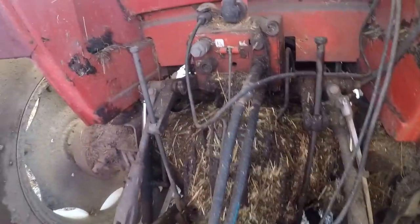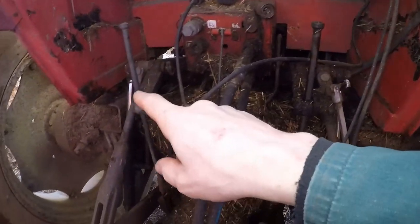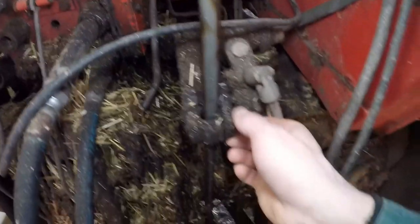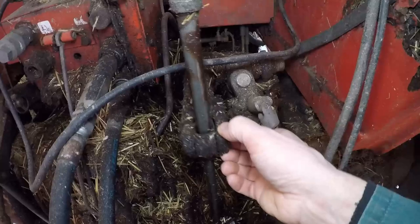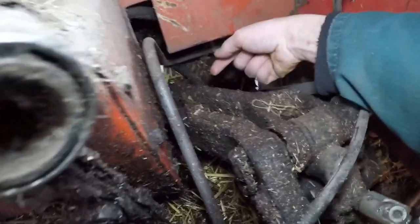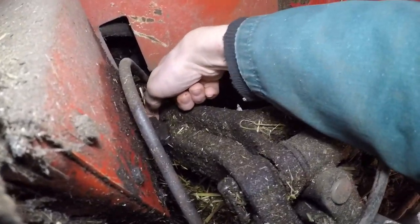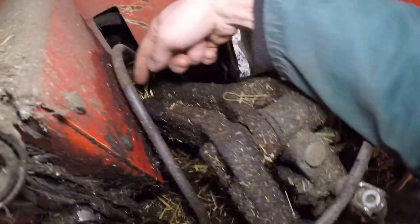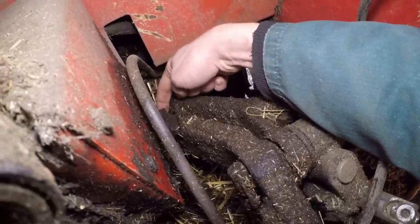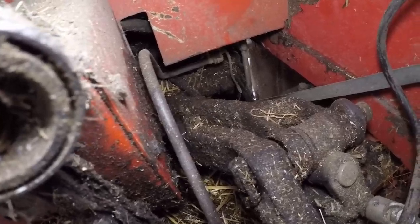Okay, so we're around at the back of the tractor now. So pickup hitch rods, lift rods are here, they drop down to pick up the actual hook, and the lifting action comes from these brackets here. You can see it's flopping around, and what there should be is a bolt right up in the front here going through the lift arm. The bolt on the other side has snapped off. So I've taken this bolt out to get a measurement for what we need for new ones.